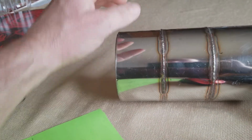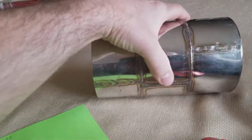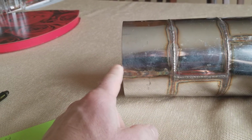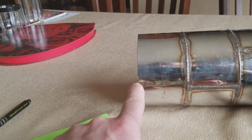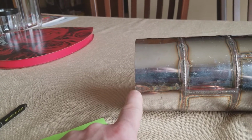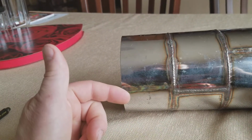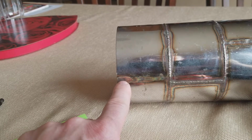So after you've got your 7 points, or however many points you want to do, picked up, rotate the drum back around, and I just used a manual probe that's got a light and a beep on it, and I put it on the end of the drum and did a visual on that. I didn't beep that off, but I picked up the X by just basically having it right here. I already knew the Y from the bore of the drum, and then the Z, I just basically touched the part and called that my Z.